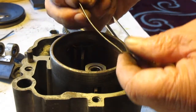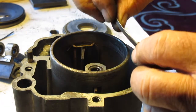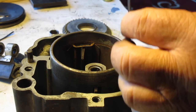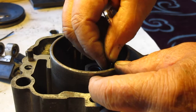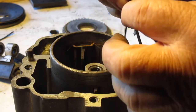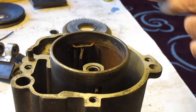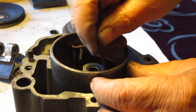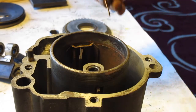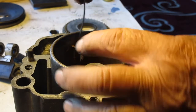Next we're going to insert the spring clips. Hold one side of the wear block in place — if you notice, the curved side goes towards the wear block and the other side goes towards the outside of the slots. Push them down all the way and put the other side in on the longer side of the slot.